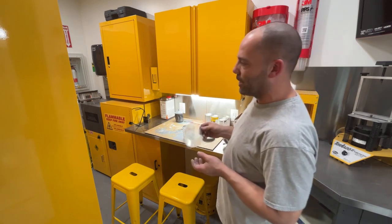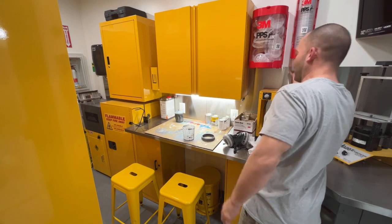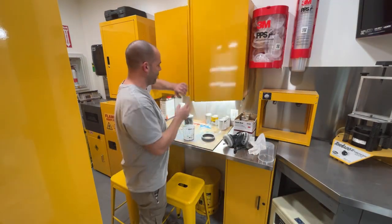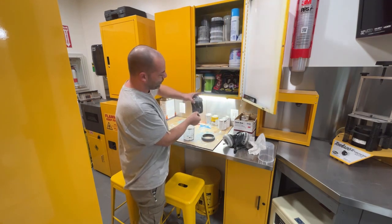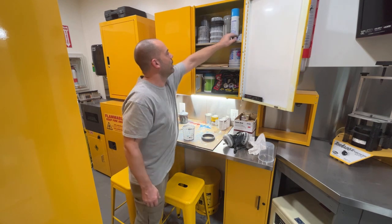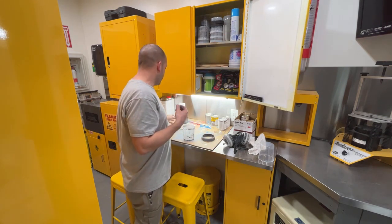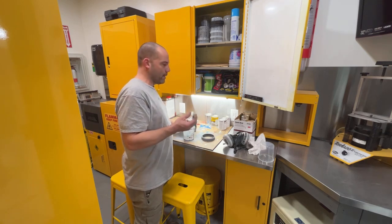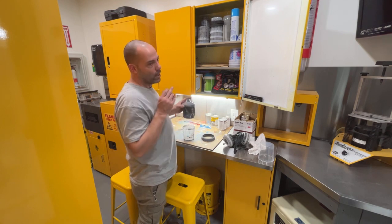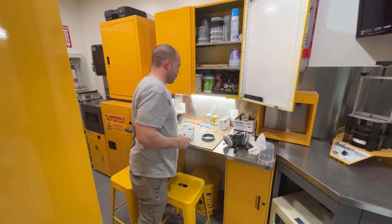It's really not that much more expensive, and the nice thing is if you have any extra material, let's say you had a little extra paint left in there, there's just a tiny bit of primer left in here. If you just leave this sit open, it'll dry and then you can throw it away. But let's say you're putting base coat on your cabinet and you have extra and you need to paint other parts. You can put this cap on there and it'll stay good in there as long as it doesn't have a hardener. If it has a hardener, then you have to throw it away.